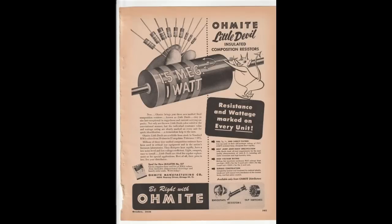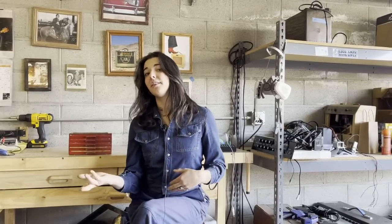Carbon comp resistors have been used widely in electronics through the 60s. After that we switched to metal film and carbon film resistors due to their reliability. Carbon comp resistors are basically made of fine carbon mixed with some sort of binder. The carbon is conductive; the binder is not. The resistance is determined by the ratio of carbon to non-conducting binder — the more carbon, the more conduction, the less resistance. Interestingly, carbon comp resistors are all sorted after they're manufactured because it's pretty difficult to get the ratio exact, so they don't really know what the resistance value is going to be until they are made.